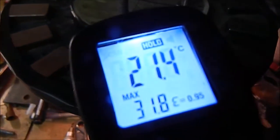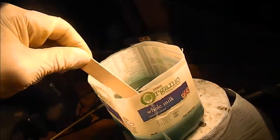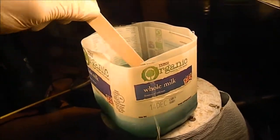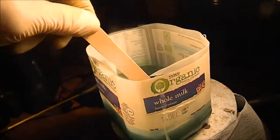It was 5 degrees the other day and it doesn't like that, so we're going to keep checking on that — keep that below 35. Just wanted to warm this up a little bit before we get going. Make sure you're in a well ventilated space using this stuff — it's bad news. This is styrene, and I was reading that it doesn't like being below 15 degrees centigrade, and it's definitely below 15 degrees centigrade now.